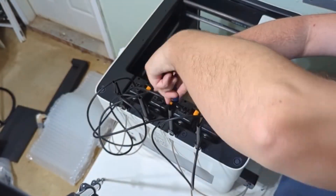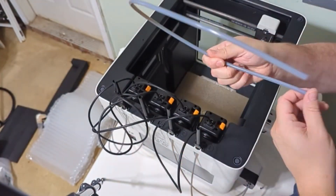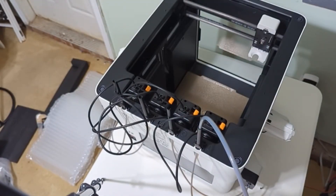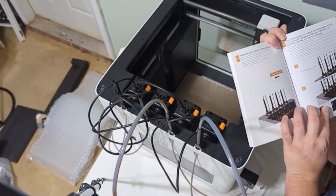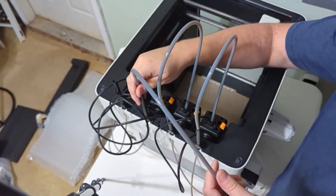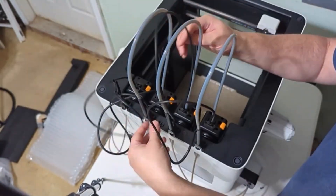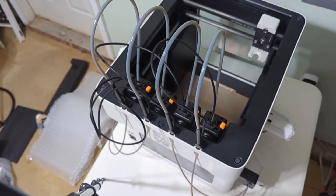This is necessary because there will be a lot of movement in the tool head. From there, you're going to take the 6mm PTFE tubes. There is one that has a notch on one side — place the smooth side directly in the back and the notched end goes directly into the tool head. Make sure your cables do not get tangled in the process.